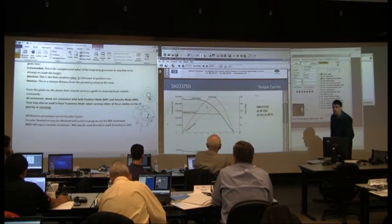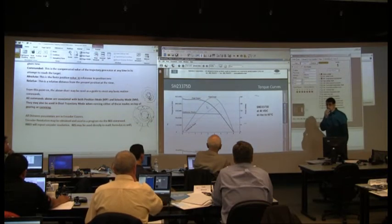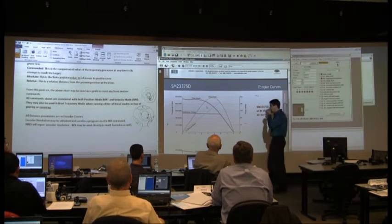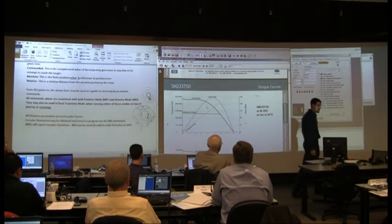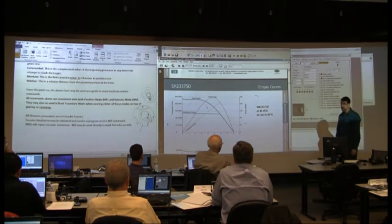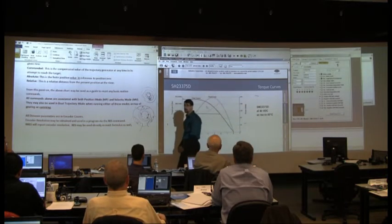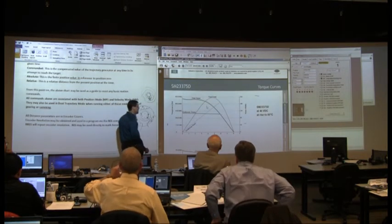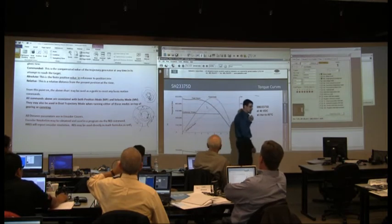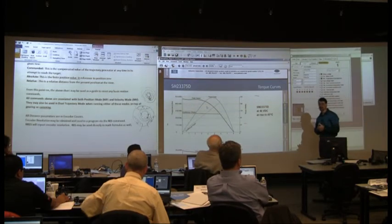Q: Did you use RMS for peak? When you mentioned the current power going through, were you watching the voltage times the RMS you got out of the motor? A: These were actually the ones done by output during power electronics — in other words, that's the power you're getting at the shaft. Eventually what we're going to be doing is current testing going into the motor to find out what it consumes out of the power supply, which means it'll go up about 10% of those.